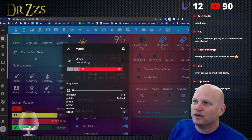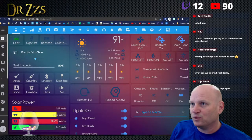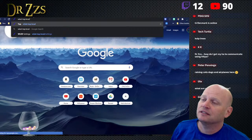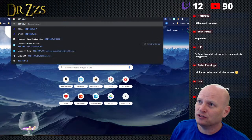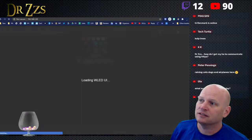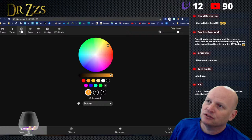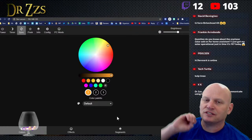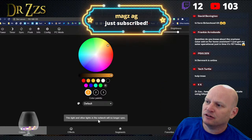All right, let's answer the question. I didn't catch the name of the person who asked, but somebody said, can we sync multiple WLED boards? And the answer is, heck yeah, you can. I'll show you real quick and try to point you to the settings you need. There's this little sync button. If you click that sync button, it says other lights in the network will now sync to this one. That means this one is outputting information to sync with. This light and other lights in the network will no longer sync. So you've got to have that sync turned on.